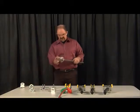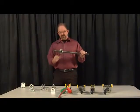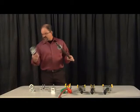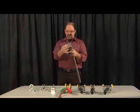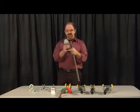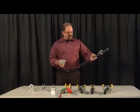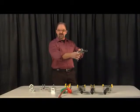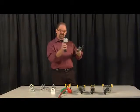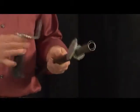And I'll show you the reason you would have this is, say you wanted to attach one of our handles to any kind of round tubing. So I've given you just our handle base here, so you can get a feel for what this pattern looks like. So you see there's this arced pattern on the handle itself, and there's a matching bolt circle on the actual clamp collar. So what that allows you to do is attach this handle to any piece of round tubing of the 4 sizes, and then what you can do is, because these holes are separated by 22.5-degree increments, you can actually shift this handle around for comfort of the operator.